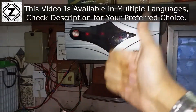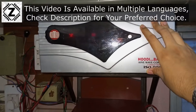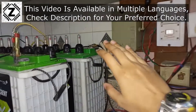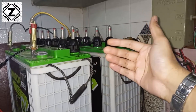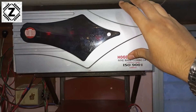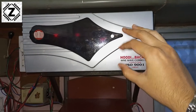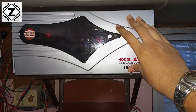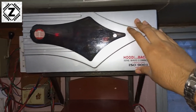Hey guys, hello and welcome to Zen Innovations. Inverters — these are humble machines which take the DC energy which comes from the battery bank and convert it to AC 230 volts or so. And just like every other machine, this inverter or this kind of converter also uses a bit of energy for itself. The energy that it consumes for itself is known as idle draw or self power consumption.